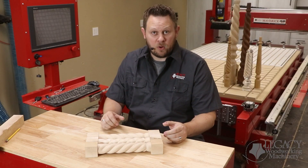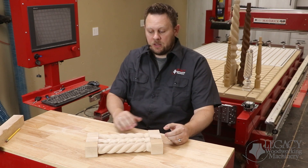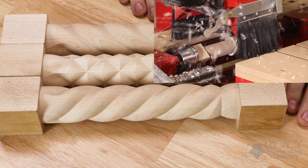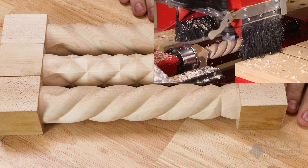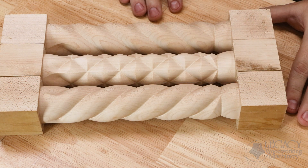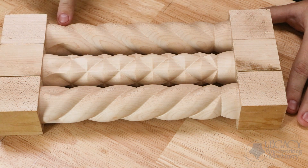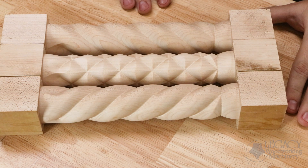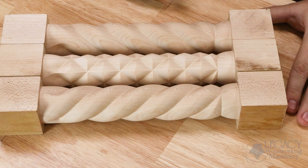Let's break down what took place and what we're able to control with the spiral effect that happened during that demonstration. The first thing that took place is simply turning round. The finish was rough, but we didn't care because we knew that the rope cutter was going to come and clean up that finish for us. Next, we used that rope molding cutter to perform these termination points here on the ends, and we left it out on the other end just to show some variations. That same cutter was then used to create the spiral twist effect, and it has the same start and ending position. However, one was going in a left twist pattern and the other one was going in a right twist pattern.